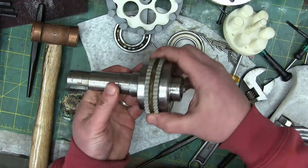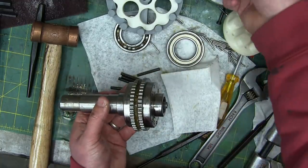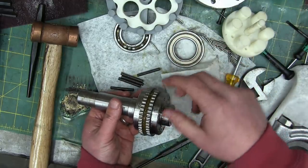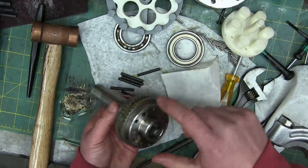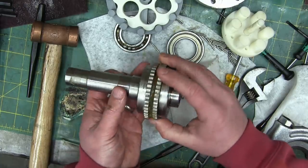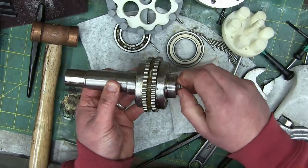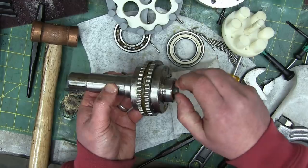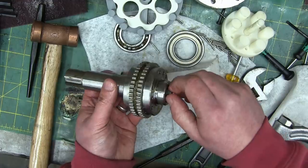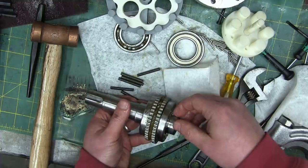So there you go — that's how it works, that's what it is. That is the typical embodiment. On bigger units there's gear lube — actual liquid in the unit. On small units it's grease. Once the grease is cooked, this is basically a throwaway item. Very interesting gear set: no backlash, very high reduction, super low footprint. The thing is fucking brilliant. Thanks for watching.